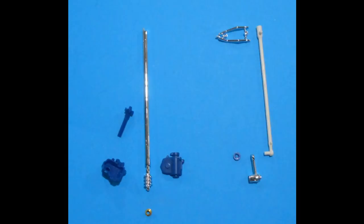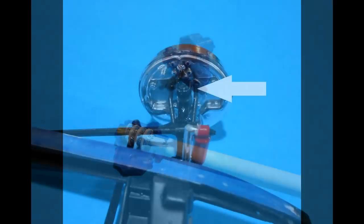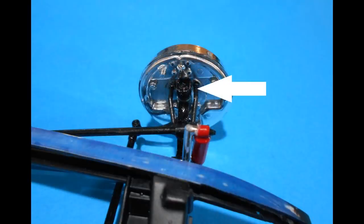That small fork there is what's attached to one of the wheels to turn the wheel. And now look at this detail. You've got a worm gear inside this box and a little spur gear on the other end. And that's what is used to use the steering wheel and shaft to turn the steering mechanism. So here's that fork that's used to turn one of the wheels. It's attached there on two tiny little points. I used some epoxy glue to keep that in place.